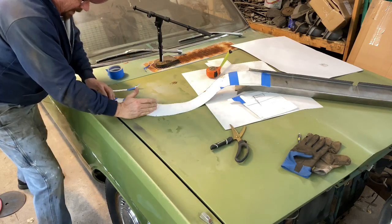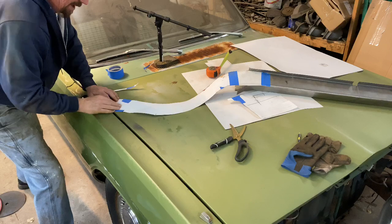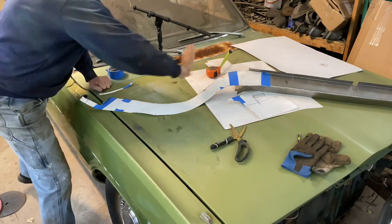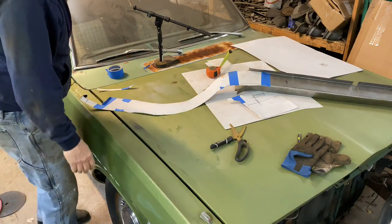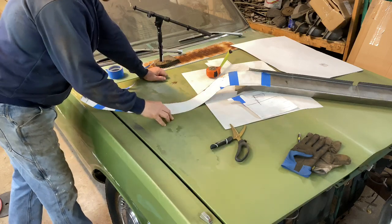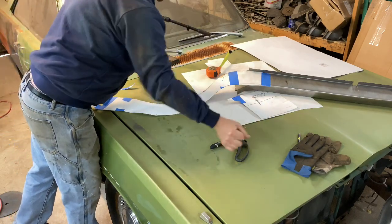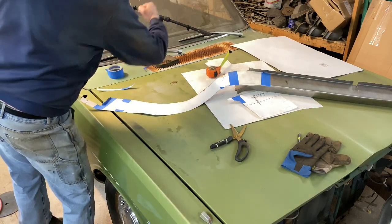Okay. So if you put your subframe connector tied into this part of the frame where all of this is down in here, it really gives that a lot of rigidity and strength and stiffens up the whole chassis. The back of it, for the most part, it's not pulling down on it very much. A little bit, I'm not going to say none. But if you've ever watched a leaf spring car launch, depending on how the car is built, it actually might pick the back end up a little bit. I've seen them do that. They generally don't pull down a huge amount on the back. It's all this up force in here that really drives that car.